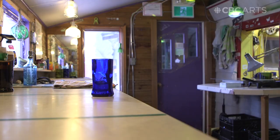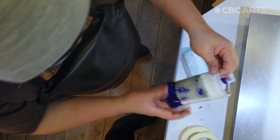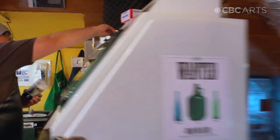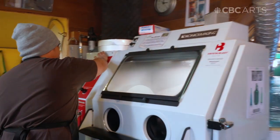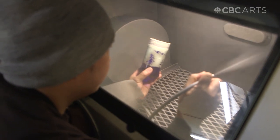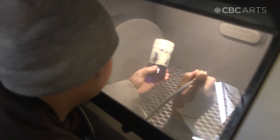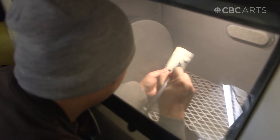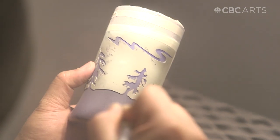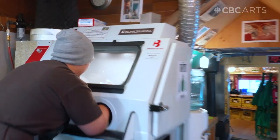So no one's going to hurt themselves using it — that would definitely not be good. After we've done the grinding and the polishing, we put on the glassware and take it over to the sandblaster. This sprays a sandy grit that hits the glass and cuts it away very rapidly. The longer you stay in one spot, the deeper it cuts. You can go from just a light surface etch to a sand carving where there's a real tactile sense to it.